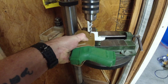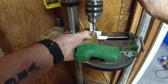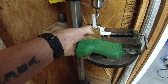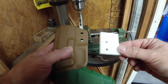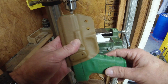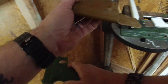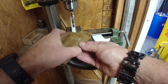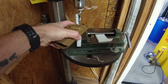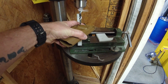For these first two holes we went ahead and put our molding prop in — not absolutely necessary, but you do want some kind of spacer in there because you want to keep the two sides of the kydex apart. Otherwise when you drill, they press together and then when they come apart the holes aren't lined up properly. Use whatever kind of scrap you want — we just had some HDPE laying around. And of course, take your prop out before you drill the actual holes for your flush mount.